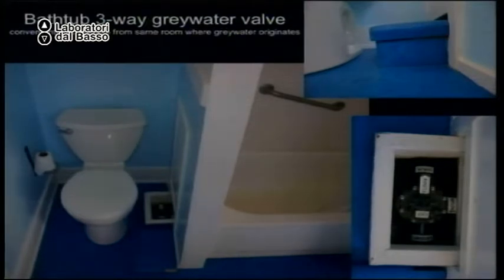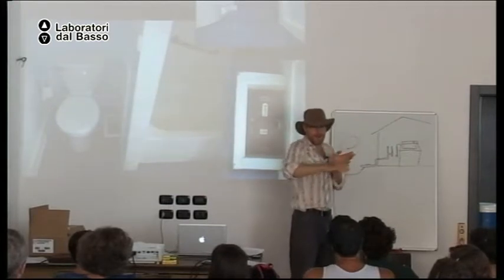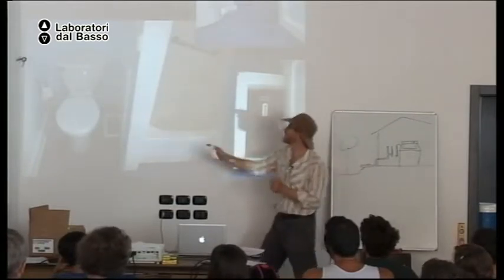So the door on top of the valve access hole, which is next to the toilet, I made sure that the door or the roof to the valve box slopes like a roof. Why did I do that? Okay. I put the door or the top of the valve box, I slope it so liquids will drain off of it like rain will drain off of a roof. Why did I do this? Where is it located?